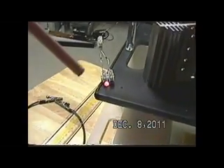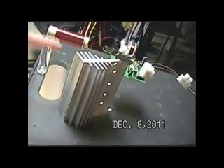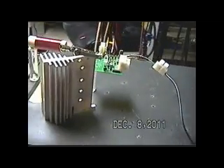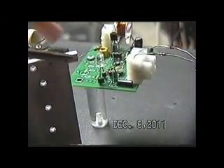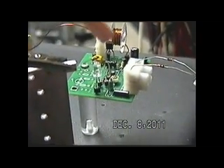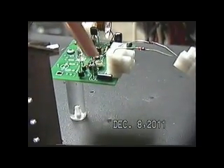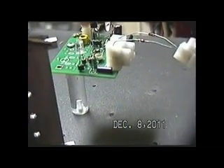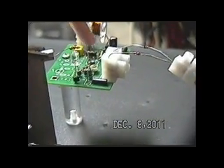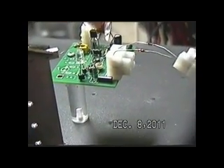What I've done to get this one to run is I've taken this piece of aluminum — its position is sensitive; I'm sorry, but these things are position sensitive, and it depends upon the size and so forth. I've taken this piece of aluminum and connected a 1 megaohm resistor to it. Now on this particular exciter — this is one of my lab versions — I have sockets down here, and I normally have a capacitor across the tuning capacitor that's soldered in. On these particular boards those are sockets, and I have removed that bridging capacitor.